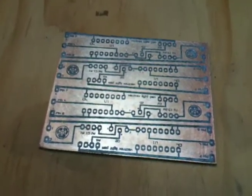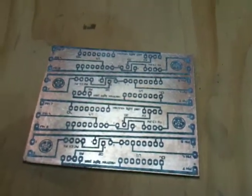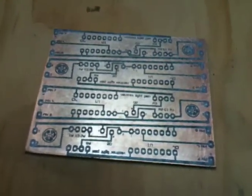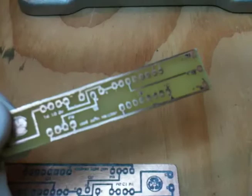I made another run at my Vectrex light pen circuit board, and again I've done the toner transfer technique here. Last time I used the Staples photo paper that was recommended on the internet pretty highly, and it didn't work so well for me. The boards ended up with a lot of slop on there. The lines aren't very clean. The text I put on there is largely illegible.